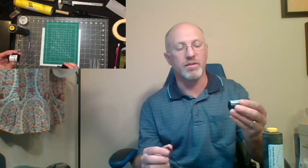So what I need to do then is, and I'm not going to do this now because I'm going to wait to do this on my Zephyr video, but I need to remove 7 seconds from the discharge. So what I would do is I would set my 8 second removal on there, but I need to take off a 32nd of an inch. I hope I'm explaining this clear enough, but instead of the full 8 seconds removal, I need to remove 1 second, which means I need to create a 1/32nd inch gap in between the tool and the drill.